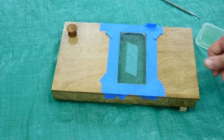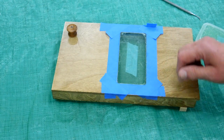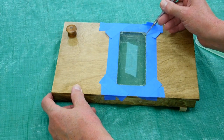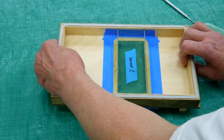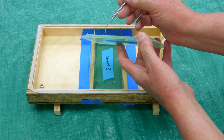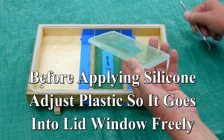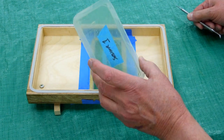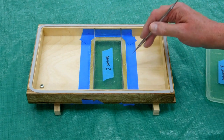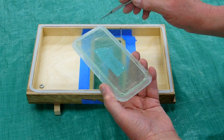I'm going to let this set up, then peel away the masking tape, try to clean up the silicone, and finally remove the plastic protective coating from the plexiglass. When pressing the plexiglass in place, don't get too carried away pushing on it — this is a very thin section, and if you break it after all your work making it, you'll be very unhappy. Plus you'll have a very sticky, gooey mess that will be next to impossible to clean up on the inside flange. So be gentle — don't crack or break it.